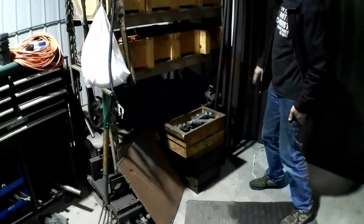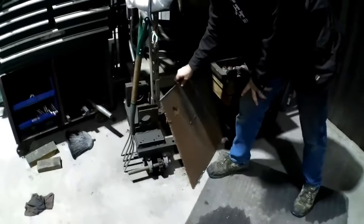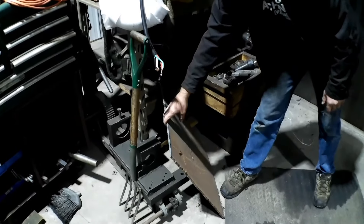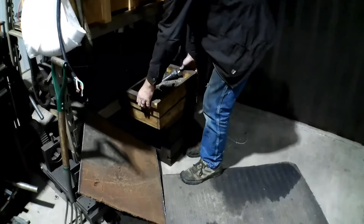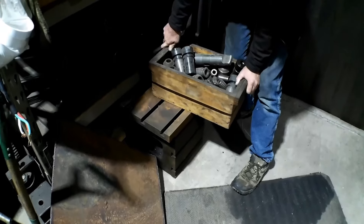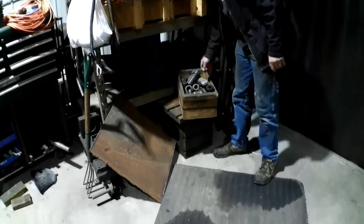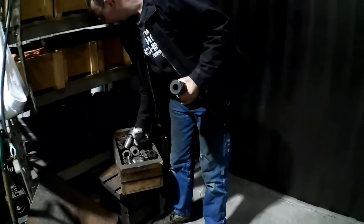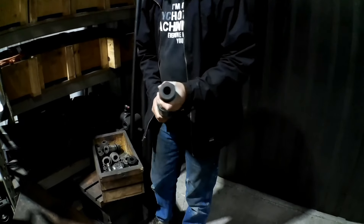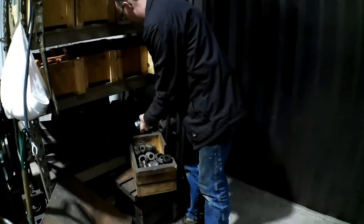We got some lifting apparatuses there. There's a big 15-inch Bridgeport rotary table back there and a 20-inch Kearney & Trecker underneath — a big rotary table I bought for use with the boring mill. Right here is actually the table off a shaper I picked up recently to use as an angle plate, given to me by another fellow machinist. Along with this entire set of boring bars and 2-inch holders for the boring mill — that's a Morse Taper 6 in the boring mill — and I've got all these holders of varying sizes, some collet style. Another great addition.